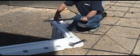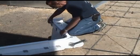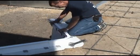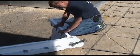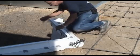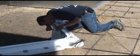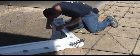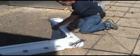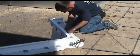The straight sections of the step are braced with metal corner bead material. Peel away the paper from the double-faced tape and stick the corner bead to the form near the top. Insert the point of the tie wire through the corner bead, running it through the form, and wrap the end around the self-tapping screws provided with the kit. This will brace and hold the form straight during the pour.